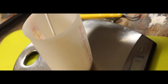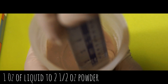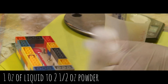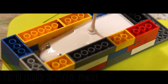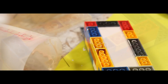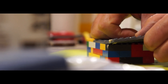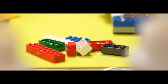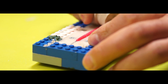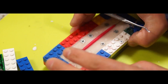Jesmanite is measured by weight at one part liquid to two and a half parts powder. I guessed at about 30 grams of liquid and 75 grams of powder, mixed it up into a slurry, and poured it on. After leaving it a few hours to harden up, I broke the boards off the mold box and removed the first layer of blocks, then removed the modeling clay, spending a fair amount of time cleaning up any overhangs, especially around where that joint was.